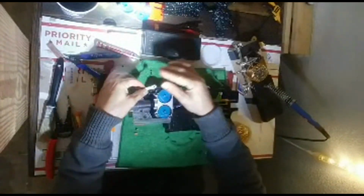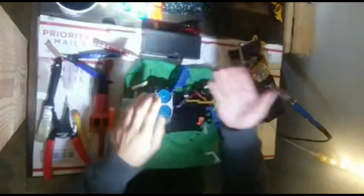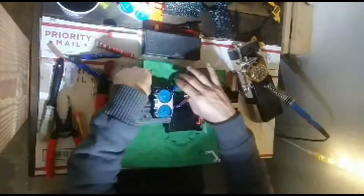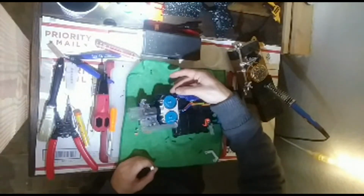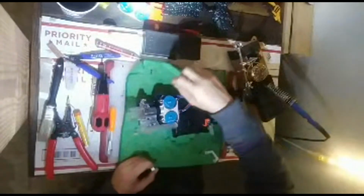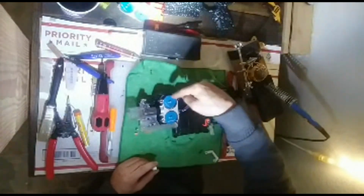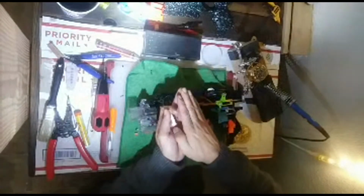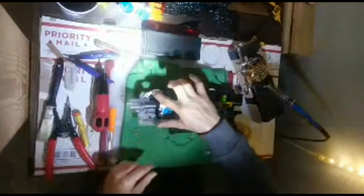If you flip it, it'll lock into the post, and you can put the other shell body on, but what will happen is you'll get a pressure gap open right here on the top, and then when you go to wrench your screws on top, you won't know what is going on, and as it gets tighter, things are going to start cracking. So, knurled, always to the front.